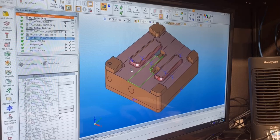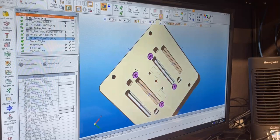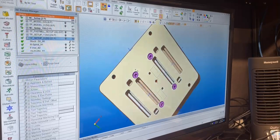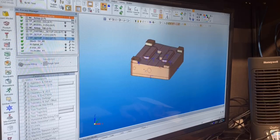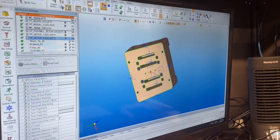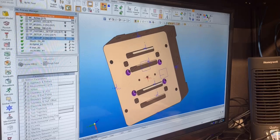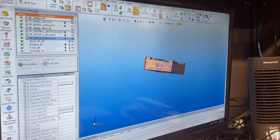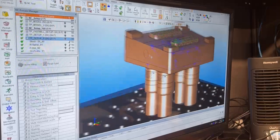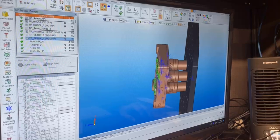This block is the hard block I was showing earlier. In the CAD, the purple area shows the fast mill locators that we put on there — those act as retention knobs for the fast mill. When this comes back from heat treat, we're going to grind the top and bottom, so we will still be grinding, but we do not have to square it with angle plates on the grinder. We're turning on the FCS/fast mill plate so you can see how it's going to be in the machine.